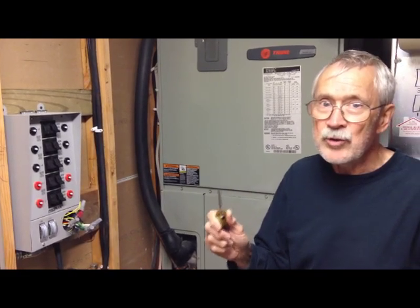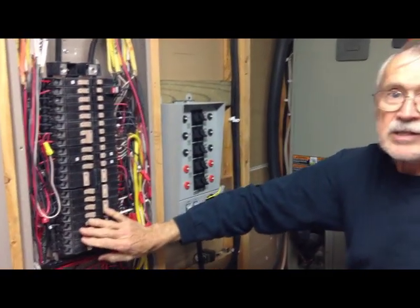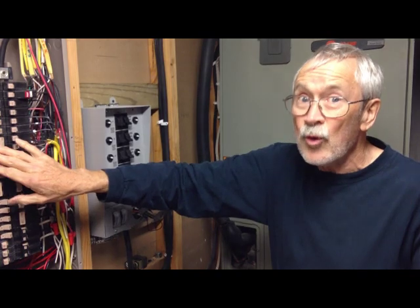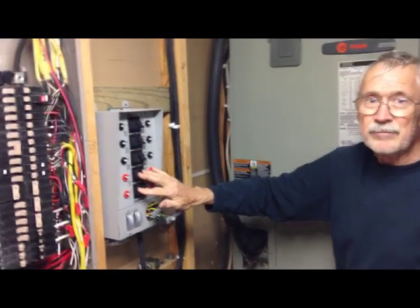The other key point: the power goes off, you're on generator power, running fine, then the power comes back on. When you come down here and flip this, it's an instantaneous switch from generator to utility. But if you had a big double-pole double-throw switch mounted up there, when you cut away and cut back on, everything restarts — there's no smooth transfer of power, it's just cut then restore. And when you do go back to utility with the big switch, you have to come down and manually throw each circuit you don't want back on.